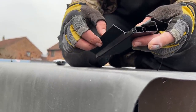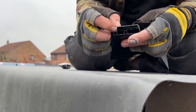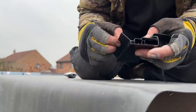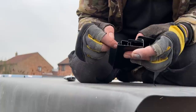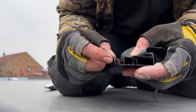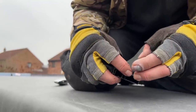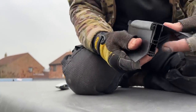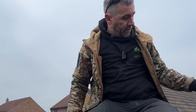Can you see how it's trapped the rubber in there? So that's your roof there — the water runs along there, it goes down there, it hits that, runs off that and into your gutter. It's a brilliant little system. If you want to get it out if you've made a mistake you do need to slide it out — don't pull it because that'll break it. Also at this time of year that can become quite stiff and rigid because it's cold and when you punch that into there it can split. We've got a couple of tricks to try and get past that and I'll show you them.